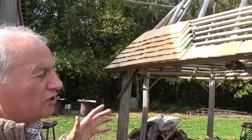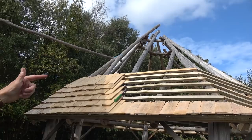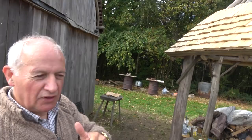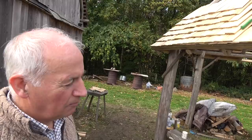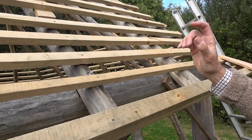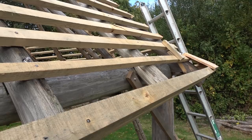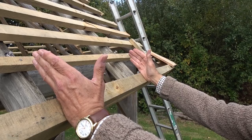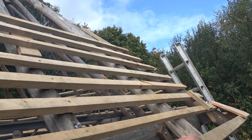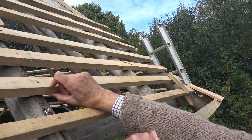What we'll also do with this structure — it's a little bit difficult at the top because we're working with round poles — so we'll get to a certain point and then measure up to the top, get a consistent measurement, and put a board around so we have a uniform distance between the battens and tiles as we go up. The other important feature: a standard batten for a traditional clay or tile roof is inch and a half by three quarters, i.e. 19 by 38, based on a distance of 400mm or 16 inches between rafters. When dealing with round poles you can't necessarily achieve that 400mm spacing, so we've increased the batten size to one inch to give more stability.